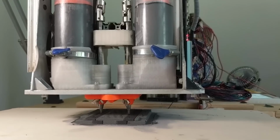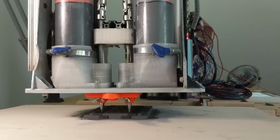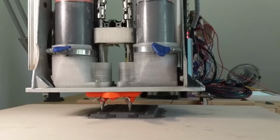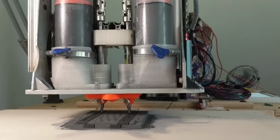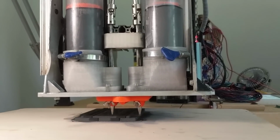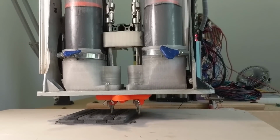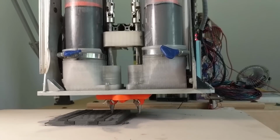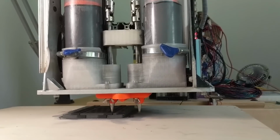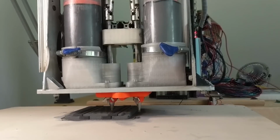Technically, we came into some issues, or we had some problems, because this first iteration of a multicolor printer, you can see that both extruders are sort of locked in place. So they don't move independent of each other. And so while the one on the left is printing, the one on the right invariably is bashing into something, or at least lightly scraping the surface of what is being printed. And so that was a constant issue. And even just getting them calibrated to be the exact same height was quite difficult, given that there was no way to really move them